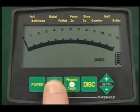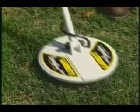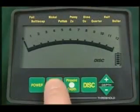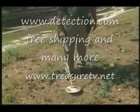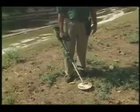When pressed, it places the detector in its all-metal mode, permitting it to sound off on any metallic object it detects. When the all-metal pad is pressed and held, Garrett's unique fast-track action begins. Go ahead and scan in a normal manner. In just a few sweeps of the coil, ground balance is automatically achieved — release the pad when this sound lets you know the detector is ground balanced properly.